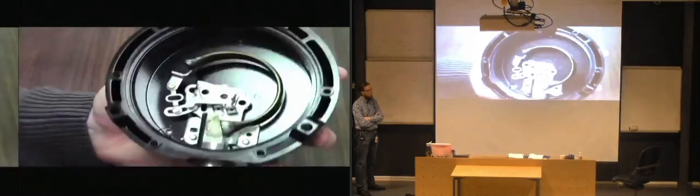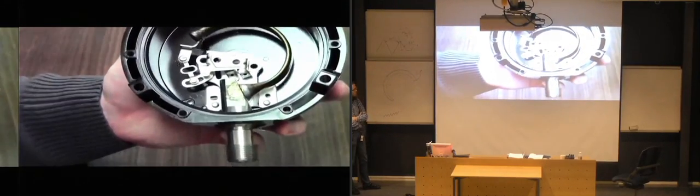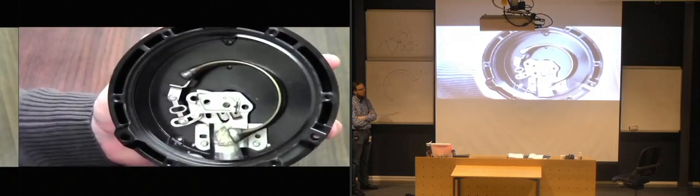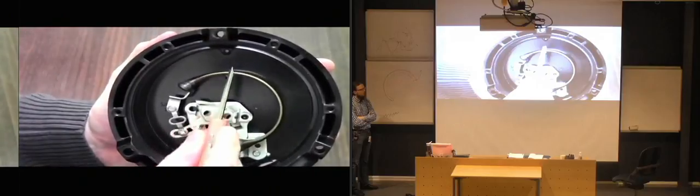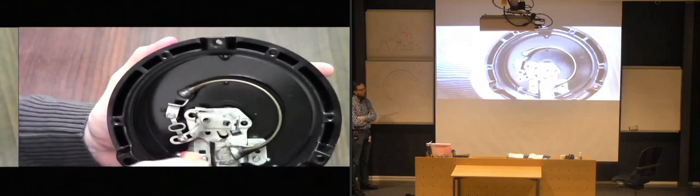So the idea behind a gauge has been around since the mid-1800s. What happens is as the media enters the orifice and then goes through the Bourdon tube, which is hollow, the pressure wants to make the Bourdon tube straighten out. That's connected to the link, which then moves the sector, which moves the gear, which moves the pointer.